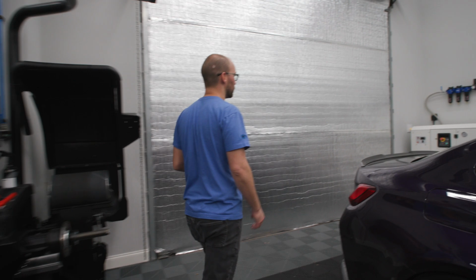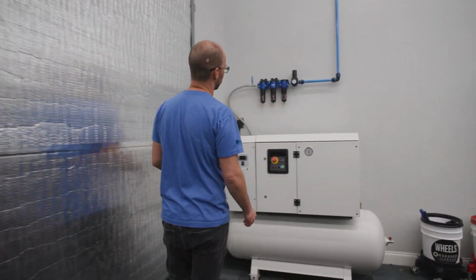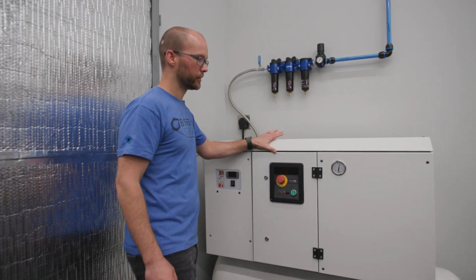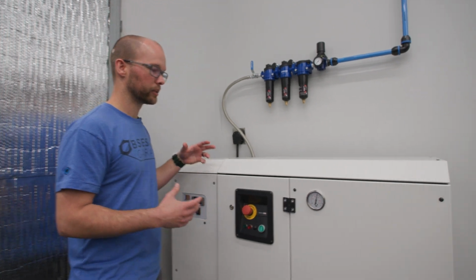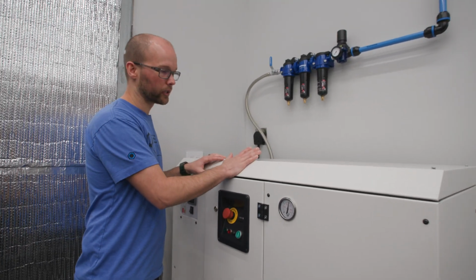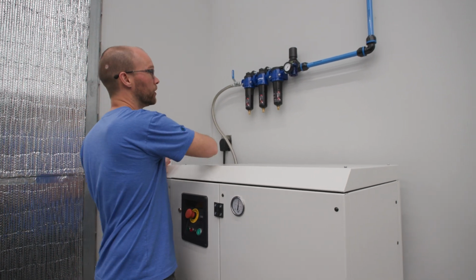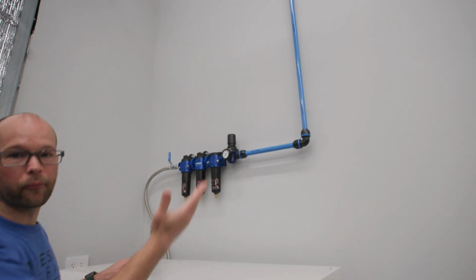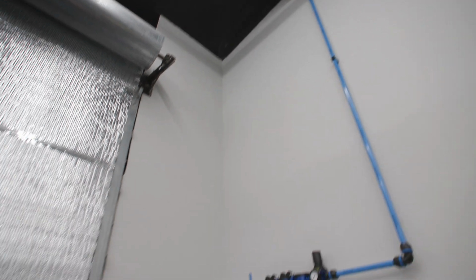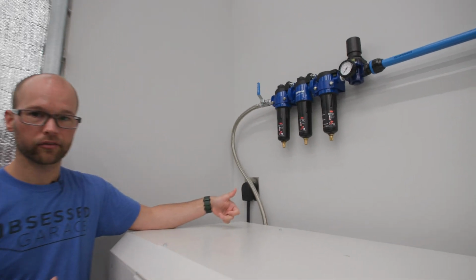And with the larger compressors like the FIAC SCS silent piston or the Werther NS or a Jenny compressor, like I was talking about earlier with them having the female NPT outlet, it's a little bit more complicated to get the process started of, okay, how do I get from the compressor to then having Prevost on my wall? And that's where we're going to use most of the time the 1/2 inch braided line. And that'll connect directly to the back of the compressor.